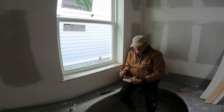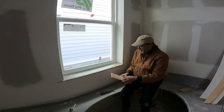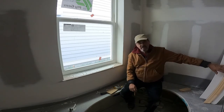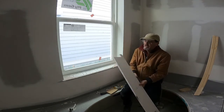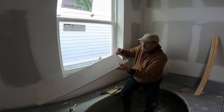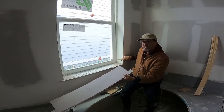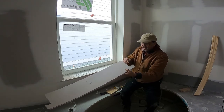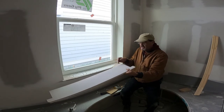Now what that tells me is I know this is going to be a 2-inch ear. So when I make my cut, for the magic of YouTube, I already have this one cut. Now I already know that this ear is 2 inches this way. So I make my 2-inch mark there. And then I know this measurement is 5 7/16. So I'm measuring from the back of the board towards the front, 5 7/16 of an inch.